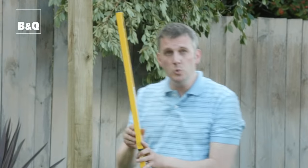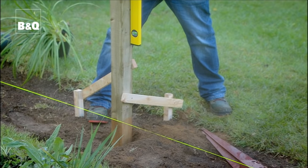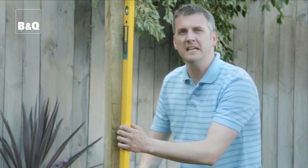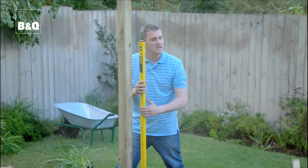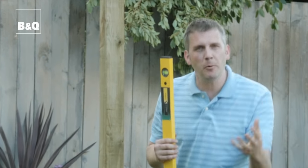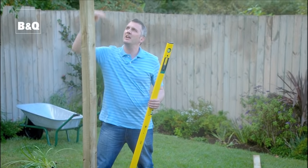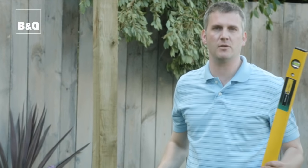Working on two sides — that's really important. You just check it level, and this is where your partner comes in: hammering pegs in at the bottom to support the post temporarily. We're not concreting yet; all we're doing is using these support posts to keep the post in the position that we want, and we work like this all along the run. Then triple check your measurements — go along checking that at the bottom it's in line, checking that it's level on top, the post is completely upright, all the pegs are in firmly. Once you've done that, time to get your panels on.